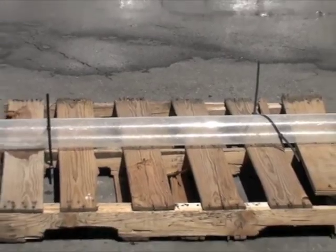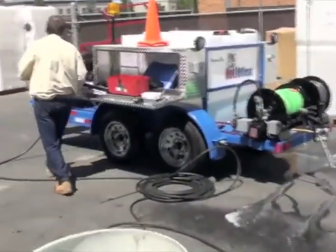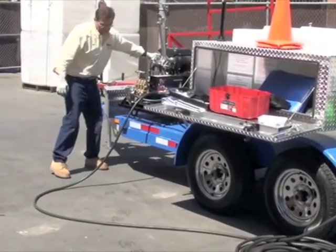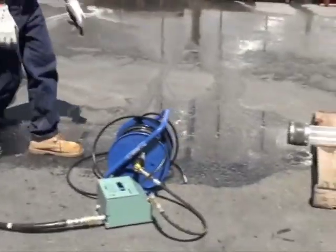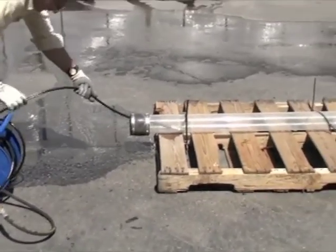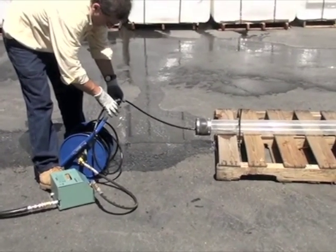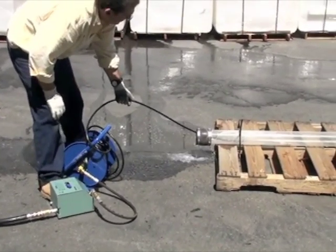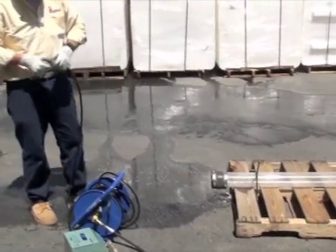Shows that. Now one thing that's really important when you shut your water off here, when you shut your water off, you're still under pressure, so you want to let that pressure off. That's real important that you let pressure off, because this hose, it's like a snake skin. It swells up and holds some pressure, so we let that pressure off. That could give you some new dental work, so be careful on that.